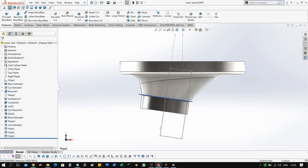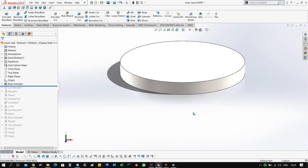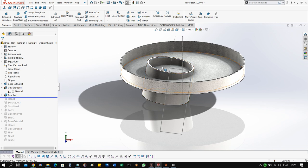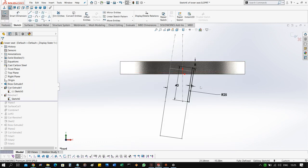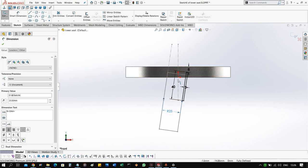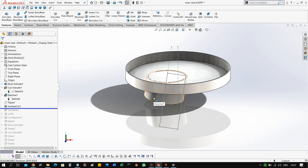The next part is the lower seating for the spring. On this axis is where the strut will go inside, but the seating is flat and perpendicular to the Y-axis. We start by making a small cylinder, use a shell or cut extrude features to make a thinner section, and then you insert a revolve feature at an angle. This feature is added where the axis is what it revolves around, and this is the thickness of the section. This angle is aligned with the steering axis, as I mentioned in Part 1 of the McPherson suspension design. To remove and close the top end, you cut this section with the surface and then combine the solid objects using the combine feature.